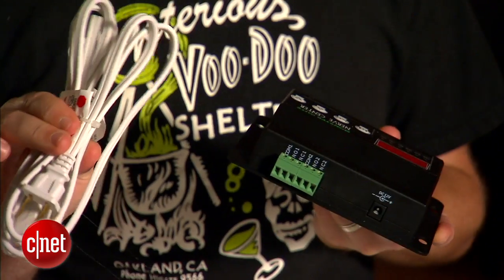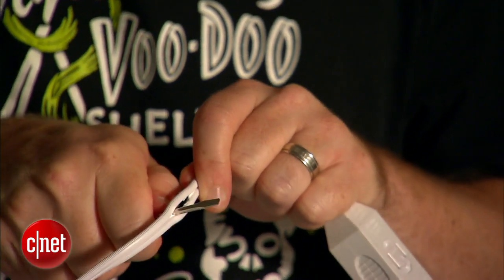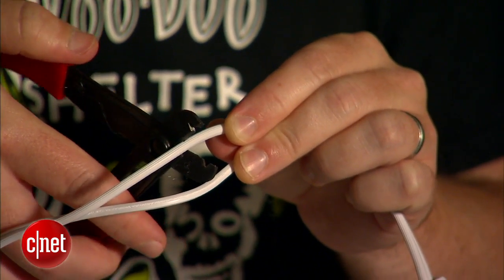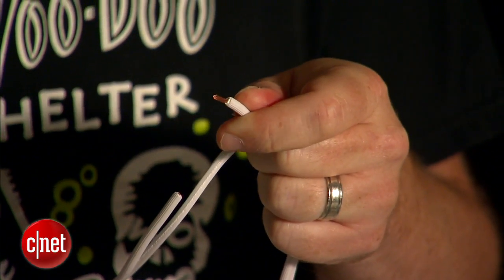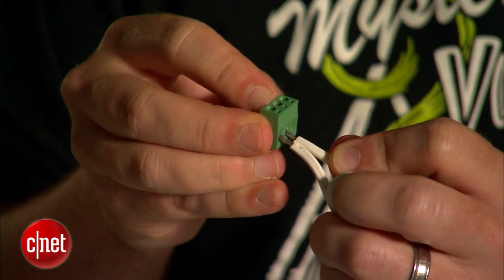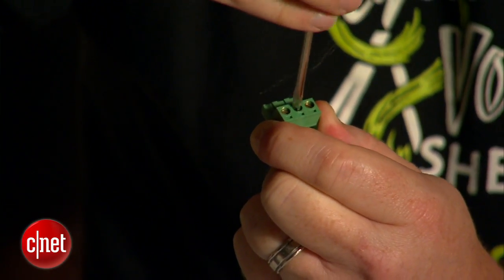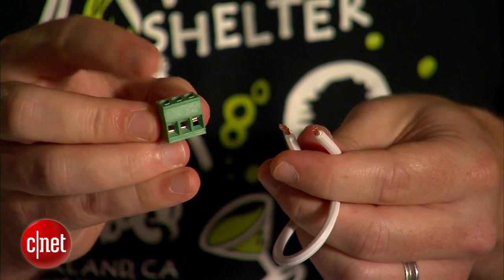To make this easy, we're going to hook these up to extension cords. For that to work, I've got to graft this connector onto the extension cord so that I can plug it into the nerve center. First, we're going to make sure our cord is not connected to a socket yet. I'll use a screwdriver to split the cord near the socket end, then I'll make a cut on one side — doesn't matter which one. Next, I'll expose about a quarter inch of the copper from the cut section of the wire.